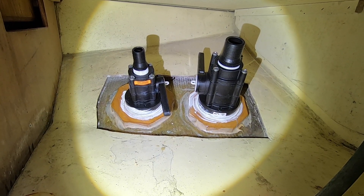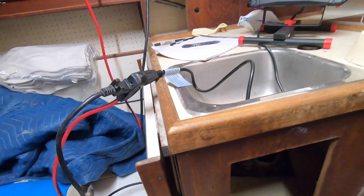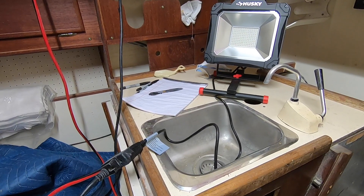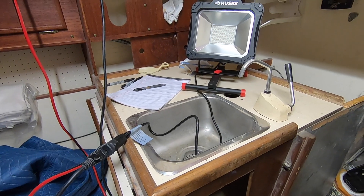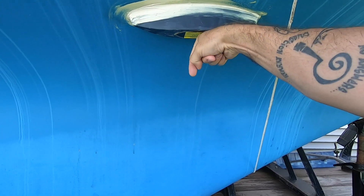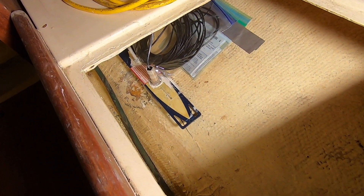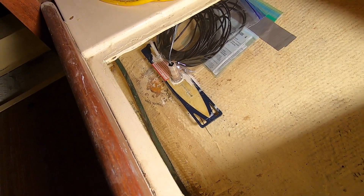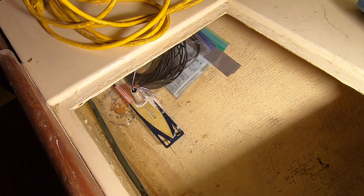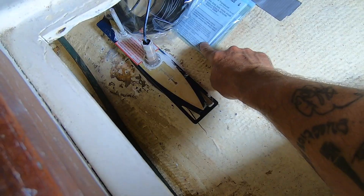Here are the two through hulls for underneath the galley — the water inlet and water outlet — and there's the sink itself. I've thought about installing a much larger sink; we'll see when I get to the interior. One item I haven't made a video about yet is the transducer. I had to put the special fairing block on because the angle of the hull here is too much — you'd be shooting off at too much of an angle. This block makes it shoot straight down. It's specially made for this transducer. Here's the inside: you can see it's straight up and down on the angled surface. I've got the wires ready to go back to the instruments, and I taped the owner's guide right there for future reference.